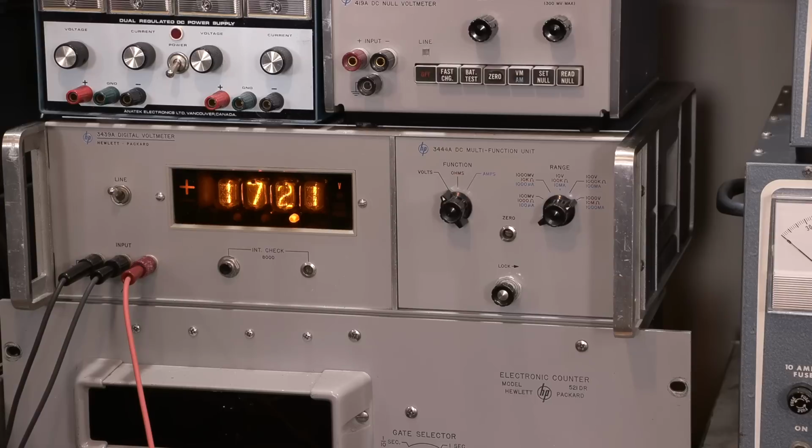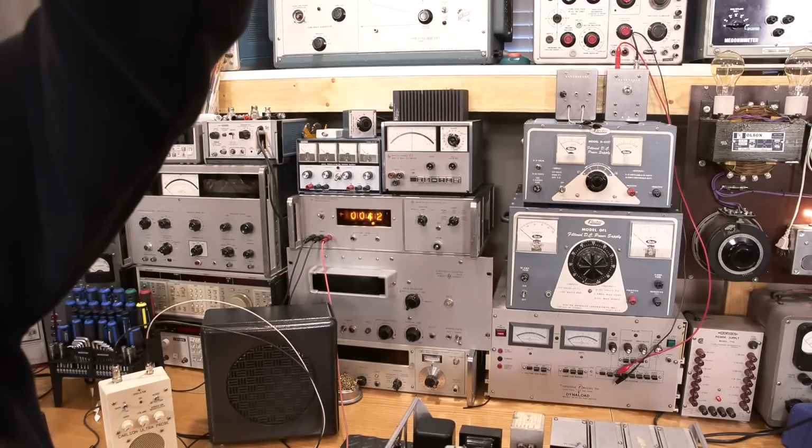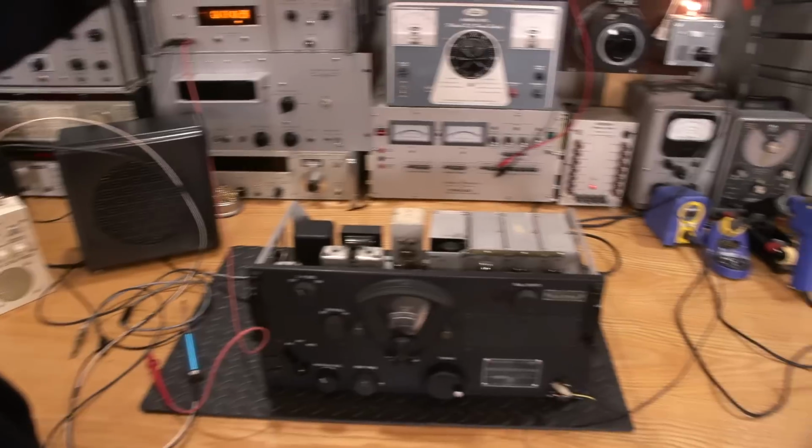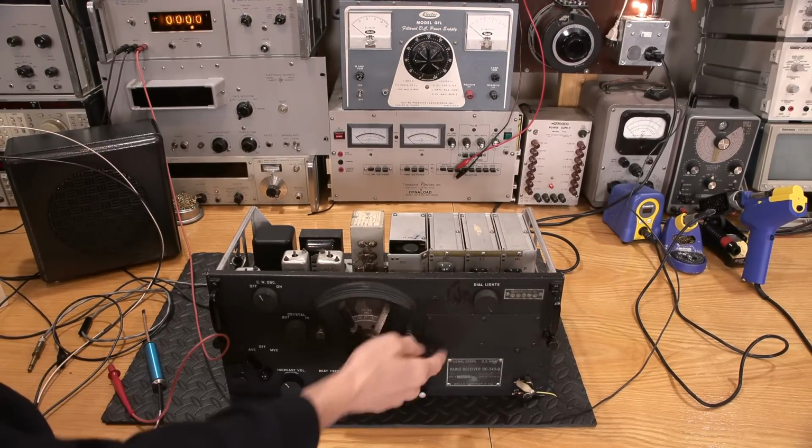So I know the circuit is drawing current. You know, we're going from almost 182 to 172, right? So about a 10 volt drop there. So it is pulling current, but the B+ is low. Now, of course, more B+ makes the receiver definitely quite a bit hotter in many different ways. So what's actually happening here at the tube itself, I'll zoom you down here. It might even be lower than that. There might be something going on.